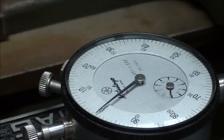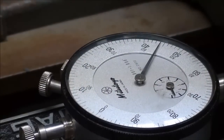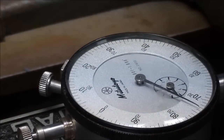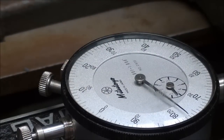I'm not using power — it's still unplugged — and the half-nut lever is already engaged, and I removed the backlash. One full revolution is starting on zero right now. I'm watching my scribe line — and sure enough, I'm right about at 77 thousandths. So my setup is successful.